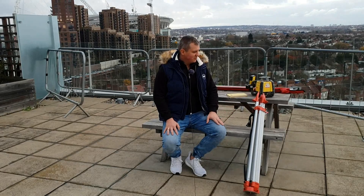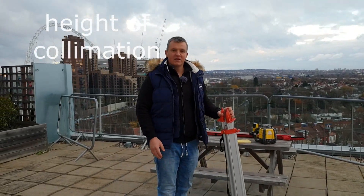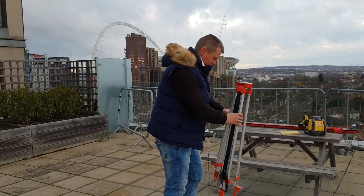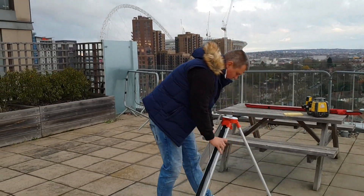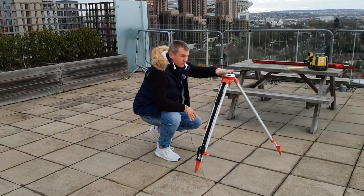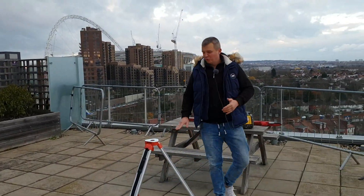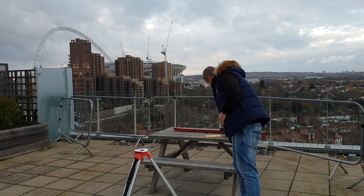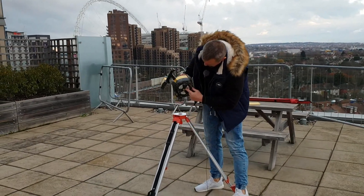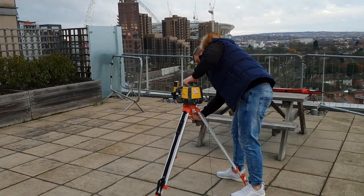Okay, we're going to set the laser now. I'm going to show you how to do it and how to get the height and set the needed height. So we're going to start to set up the tripod. We just try to keep it quite level — despite it self-leveling, you always try to do it like this. As you can see there is a bolt here and you got a thread here, that's how we're going to set it on the tripod.